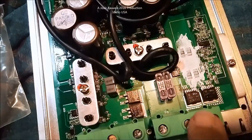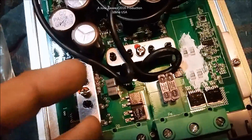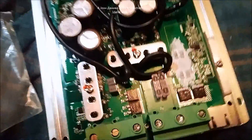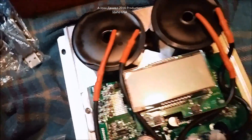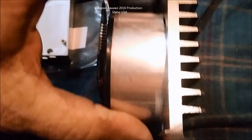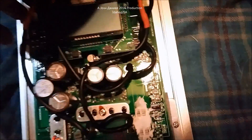These diodes are mounted on the board — I'm sure they handle reverse current because they're right near the fuses. There are two soldered-on-board fuses, which is probably why this model is a little cheaper than other Tracer models. However, look at this — it has big heavy gauge wire, two toroids, and they are very well anchored in what appears to be an aluminum, possibly stainless, tubular case fastened to the base of the heat sink. The heat sink itself is roughly half an inch, with tapered edges — that is definitely professional.